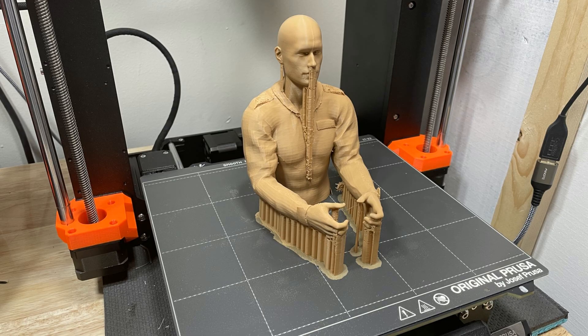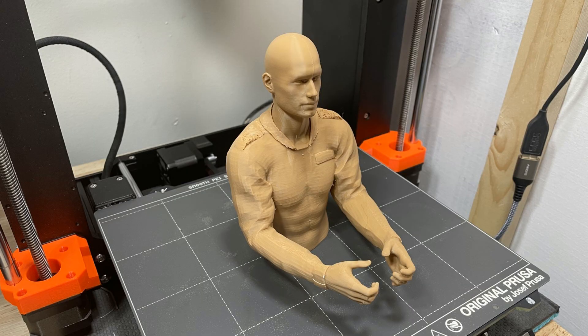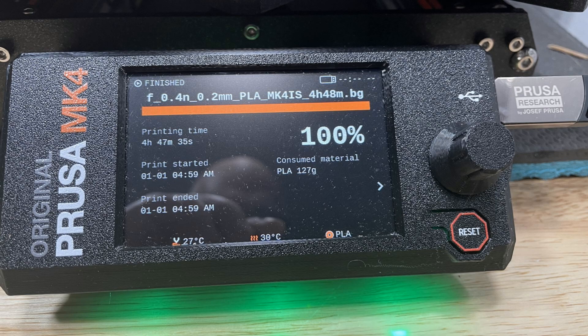I was really excited with this first test run to see how it was going to work and what quality I'd get — this was the first time I was experimenting with 3D printing a character out of Daz Studio that I can share on my Patreon. I'm making a lot of different characters because it's hard to have a pilot and co-pilot that look exactly the same. As a warning, you are going to have some long prints — that figure took four hours and 47 minutes at a layer thickness of 0.02mm.